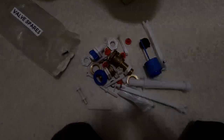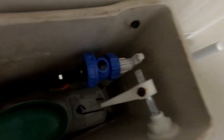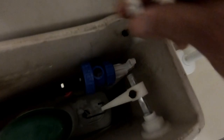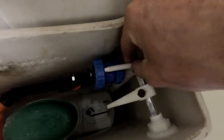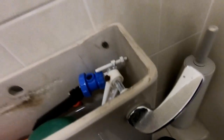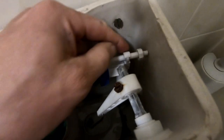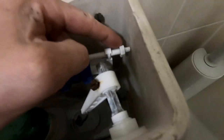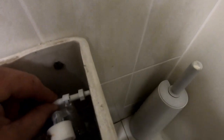I've just had to remove the little top part to allow me to feed this threaded rod in through there like so. This one won't need two nuts because that part there is actually threaded, so that nut there just locks against it as a lock nut. We just want to wind this in until it touches the cistern, just to support it — I like to give it a little bit extra just to make sure it's tight.